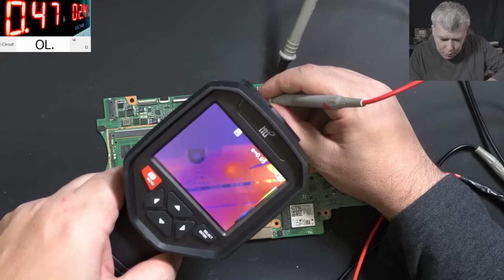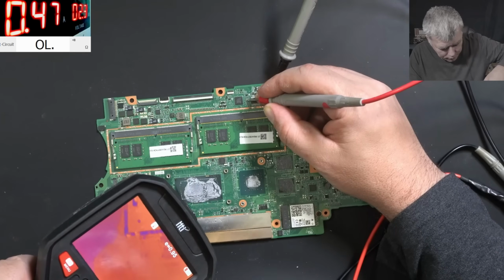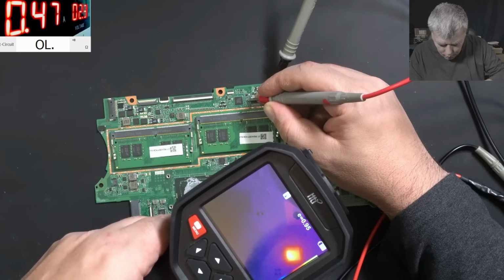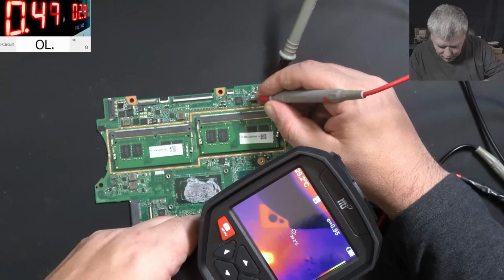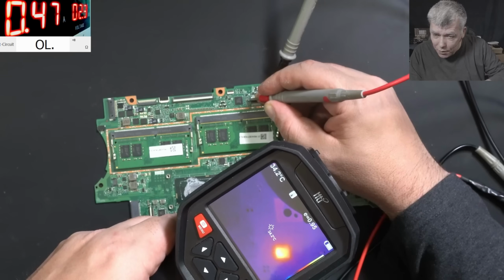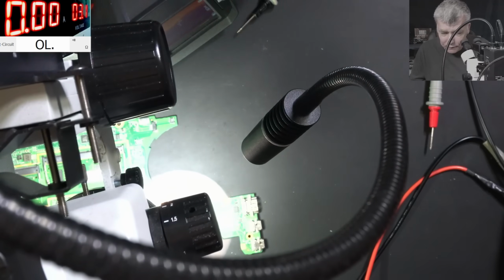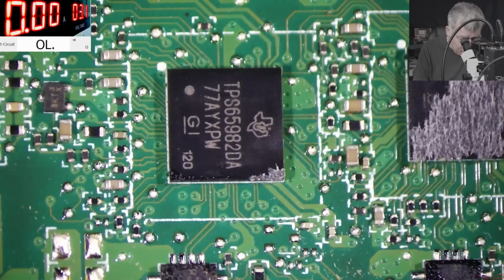It's going to the EC chip, but that's fine. That's what I expect. And it's going somewhere else. What is this? What is this? Now you figure out where the LDO 3.3 is coming from? From this little chip, which probably is burned, the TPS. Because that's why only one port is working. Yeah. This one is gone.